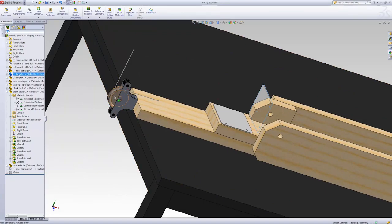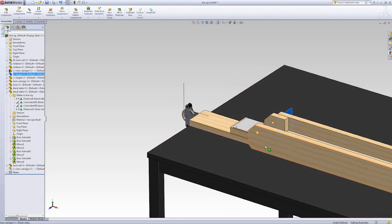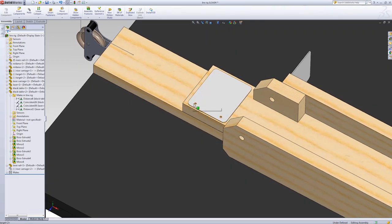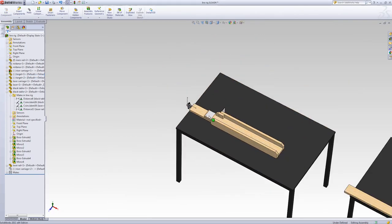And here I have just a little pulley that will have a line with some weight, because the standard in paragliding is to have a line tension of 5 kilos when you measure the length, to make sure it's nice and straight and a known amount of stretch. And this is just to give me a couple holes to put the little reflector away when I'm not using it. Okay, so that's the riser slider side of things.